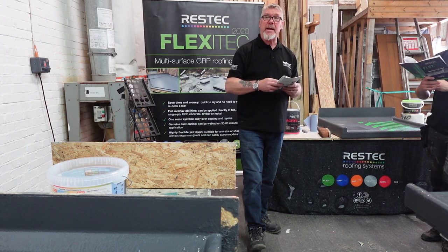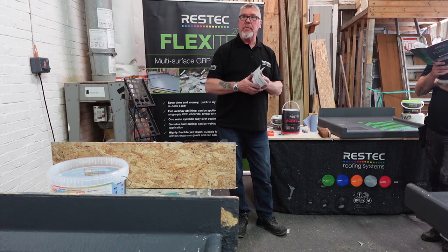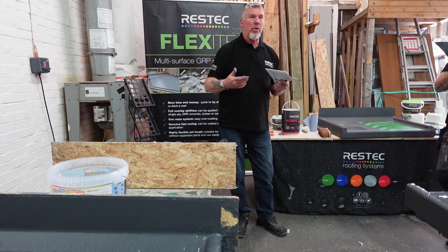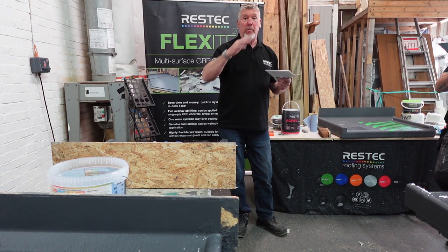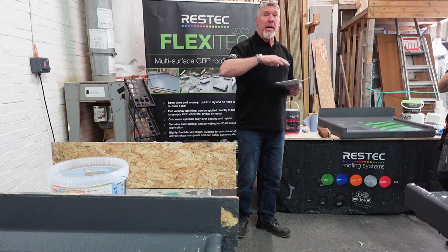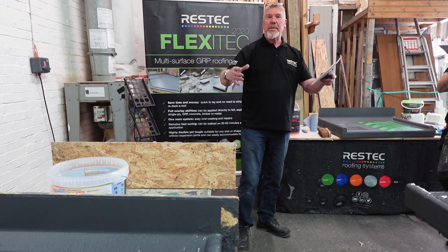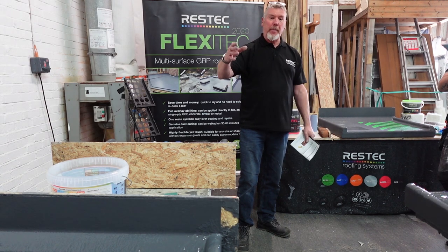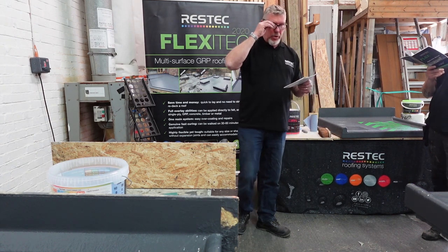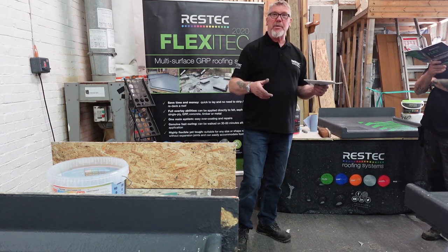Okay, flicking over, flat roof detail guidance, yeah? That little chapter 3 there could actually go on for the rest of the book, because there's so much guidance on flat roofing, but really what you remember is 150 upstands, make sure you've got a good fall, 1 in 80 falls if possible. Now if you're buying firring strips for your timber, they're already set at 1 in 80, so you should be okay with that. If you're doing a balcony and you've got to put a slight fall into it, it's best to have a slight fall in your roof, yeah? Because when you put your patio table on there and your glass on there, a 1 in 80 fall is not going to make your glass slide off the table, yeah? But it will actually get all the water off the roof, okay? You'll not notice it. You'll not care there's a 1 in 80 fall in there, okay?